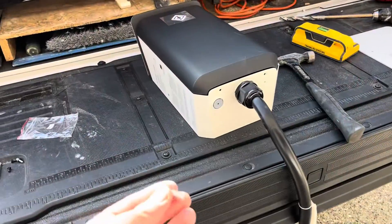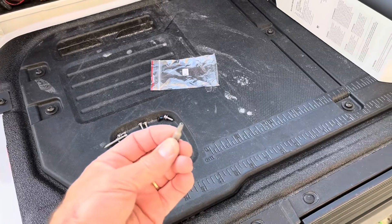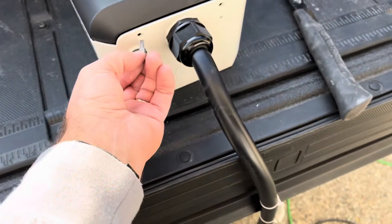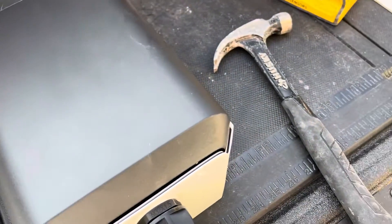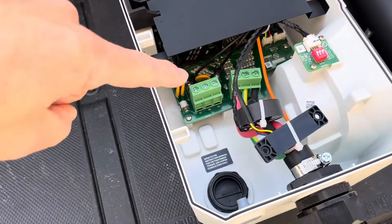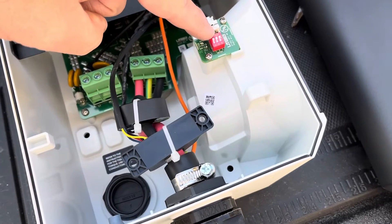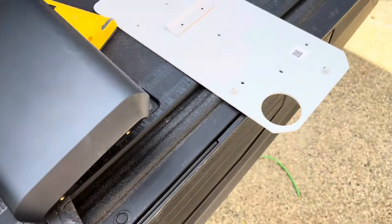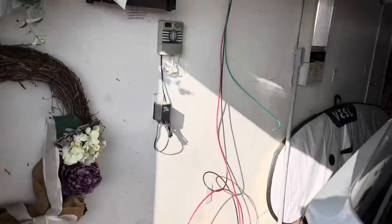In the little hardware kit were the mounting screws and there's a little Torx bit for taking the cover off the front of this. Popped those out, take the cover off, and obviously this is where our electrical is going to go. We're doing 60 amps, so we've got the three dip switches in the on position, and we're going to get the mount on the wall after I run my conduit to see exactly where it's going to go.